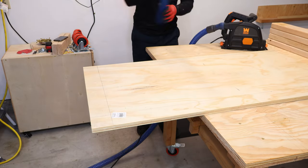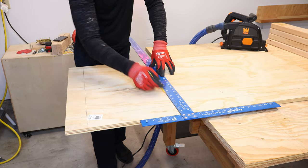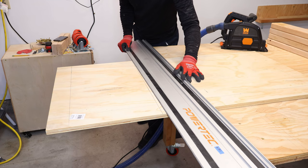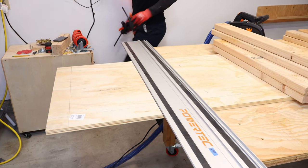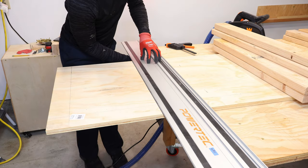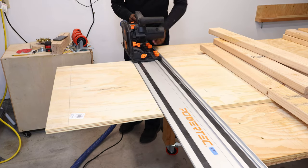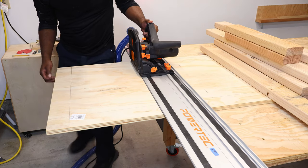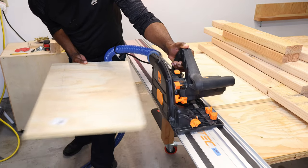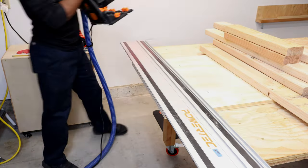The first thing we're going to do is take our drywall square and mark out where we need to cut our project panel. You can pick up this project panel from any of the big box stores. We're going to use either a circular saw or track saw — in this case I'm going to be using a track saw because of the dust collection feature and the clamps to help keep the track in place. When you cut this, make sure you take your time, go in a straight line if using a circular saw, and grab the offset piece so you don't want that to drop to the ground.